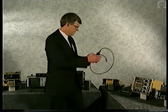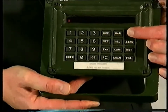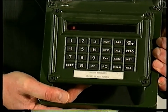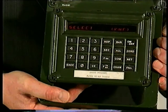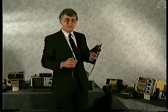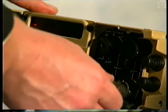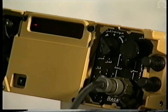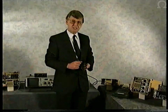Programs are normally downloaded from a fill gun device. Initially, the programs are put into this programmer. The operator can pull all the information including frequency and hop codes into this device. They are then transferred into the fill gun, which is taken to individual radios and connected to the front audio socket. Transfer is automatic and as soon as the operator sees a green light, he knows that the program has been successfully downloaded.